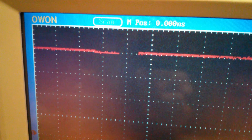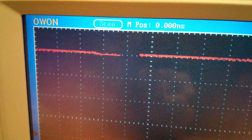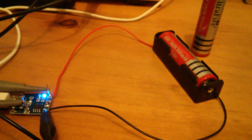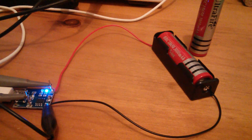You can also see on the red trace that the battery's terminal voltage — the voltage across the terminals — has dropped down ever so slightly. That's because lithium batteries are not trickle charged. When the charge is completed, the charger simply switches off and that's it.